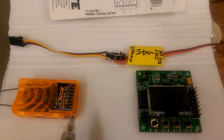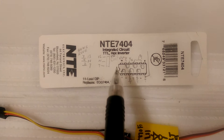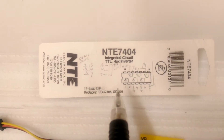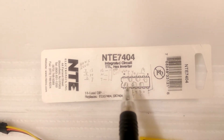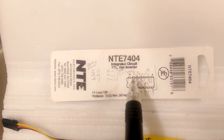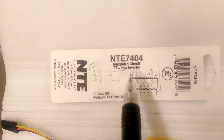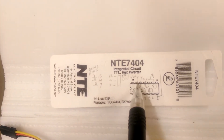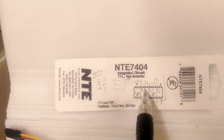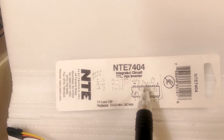In order to accomplish that, I used a 7404 IC, which you can purchase from Radio Shack or any other electronic supply house. This has six inverters present. I'm only using the one between pins 13 and 12, but you could actually use any of the other inverters if you like. You have to connect the input signal line to pin 13 and the output signal line on the other side of your connector to pin 12.